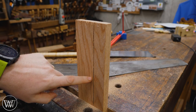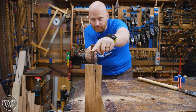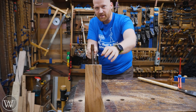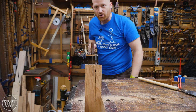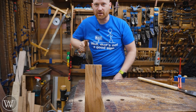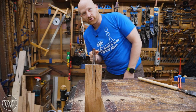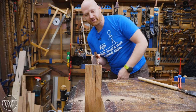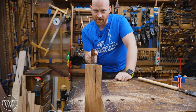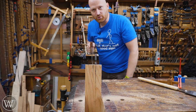Now, what happens when the saw kerf looks perfect on this side, but you flip the board around and you're way off the line? In that case, you have an alignment issue. The saw needs to be in line with your wrist, your forearm, all the way up to your shoulder — all of this should stay in a perfect stroke so that you're running straight down the line. If your elbow gets out, the saw wants to come over that way. If you're leaning over too far with your elbow back the other way, your saw is going to go off that direction and your elbow and shoulder will be going all over the place.